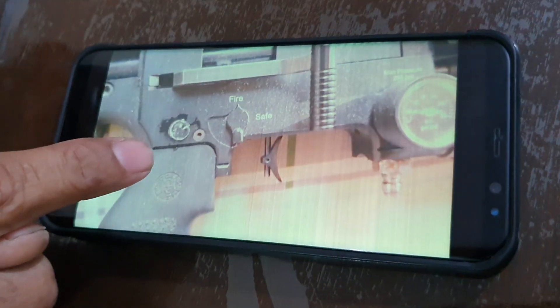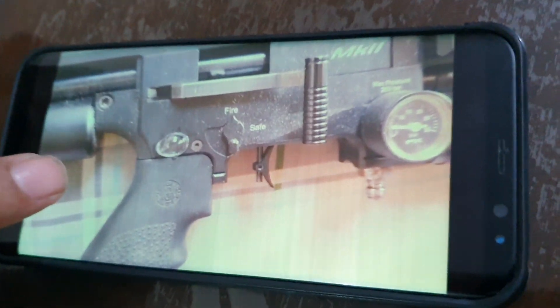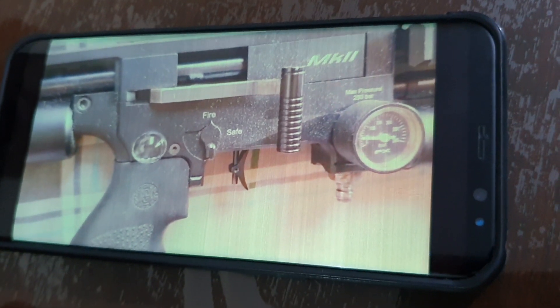Now the user wants me to install my custom-made external plenum in this gun and to make it shoot well and consistently with slugs. Although I was told this gun had been fixed by someone, when I received it I checked the regulator — just see this, this is the regulator breathing hole — see how the bubbles are coming. You can see the regulator is leaking. All the o-rings of the regulator and even the piston of the regulator are in bad condition. I can't say how much it will cost to fix all this.